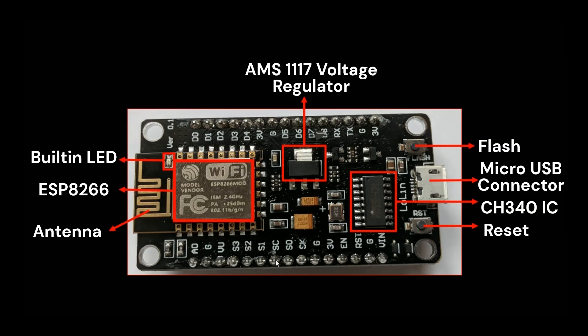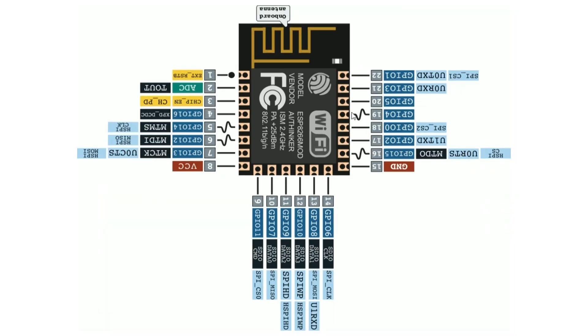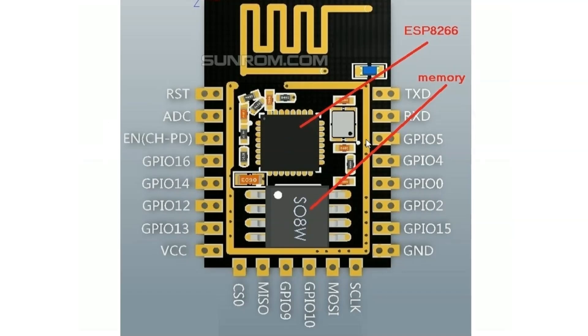Next we have the SK, S0, SC, S1, S2, and S3 pins — also known as GPIO 6, 7, 8, 9, 10, and 11. These pins generally have two functionalities. Looking at the ESP8266 chip's internal pinout diagram, you can see how these pins are mapped internally.